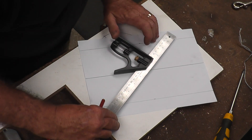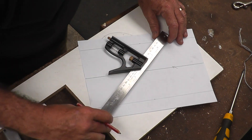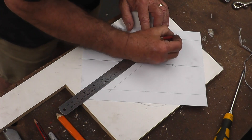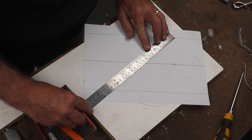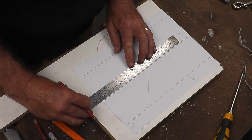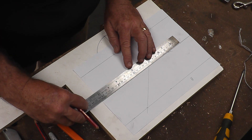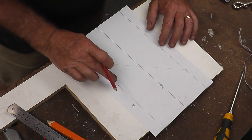Now you need a line at 45 degrees to your center line. The reason I've done that is we need this measurement here — from that point to that point — which is 220mm. So I'll write 220 there so I don't forget it. 220 from the center is 110, so 110 that way and 110 this way. Just double-checking: that overall distance is 220 — yes it is. So my oval is going to be that wide and that long.